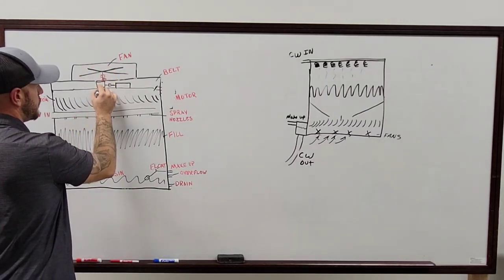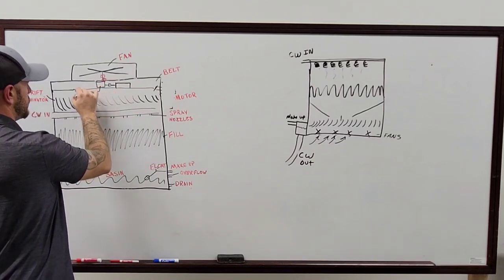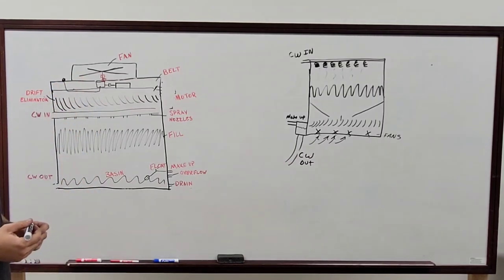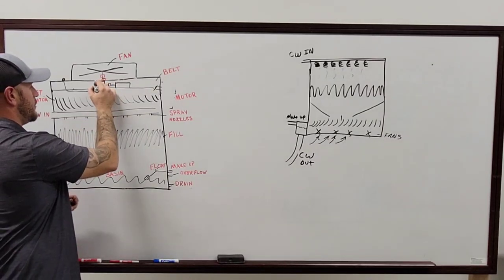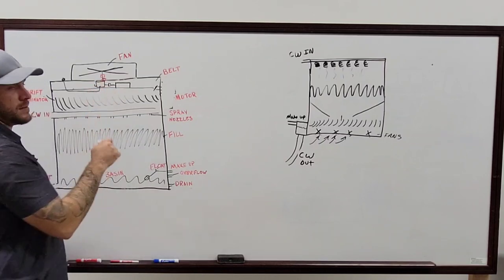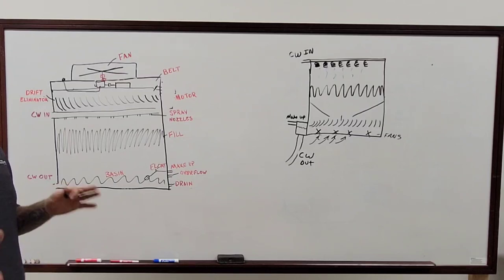There's usually a 3/4 hose or a 1/2 inch hose here on the bottom that's running back this way and usually goes up to a little level check on top of the tower. If you're lucky. There's a 90. A lot of times, there's usually only a 90 mounted right to the backside of it, and you can just take the cap off the backside of it and stick your finger down in there. If you feel oil down in there, most of the time the level's okay.